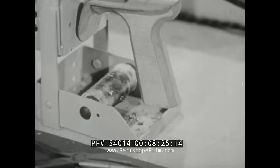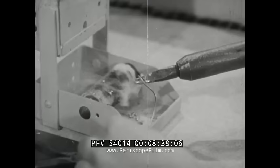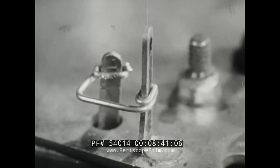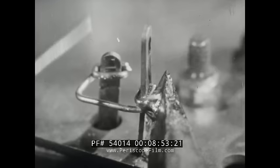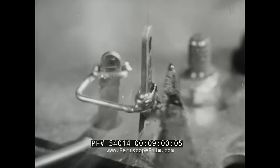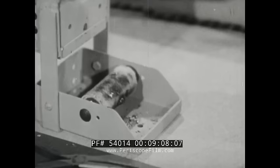Many operators prefer an iron with a pistol grip. Before using the iron, clean the tip on the canvas wiping pad. Be sure the iron is tinned, then test the heat. In soldering vertical terminals of this sort, first place the tip as flat as possible against the joint to heat it. Then form a trough between the iron and the lug. Melt solder into this trough. Now press the tip flat against the terminal — the entrapped solder will conduct heat efficiently so that solder applied to the other side will flow evenly. Apply just enough to cover the joint. Should there be an excess, it may be picked up on the tip of the iron and wiped off on the canvas pad.